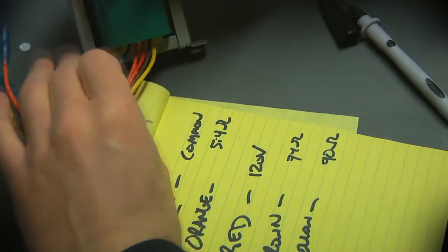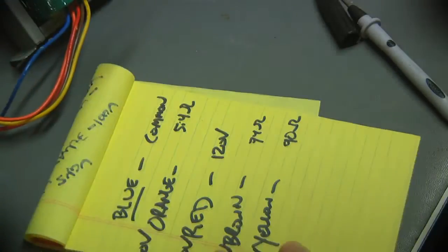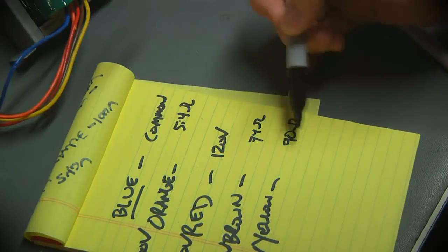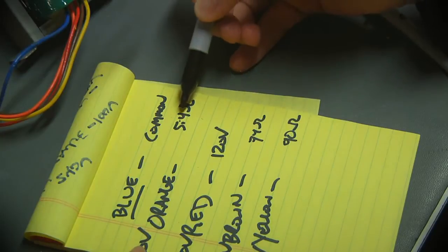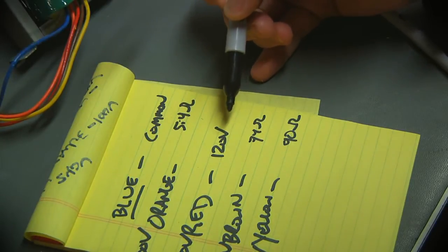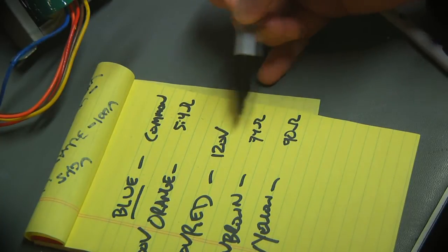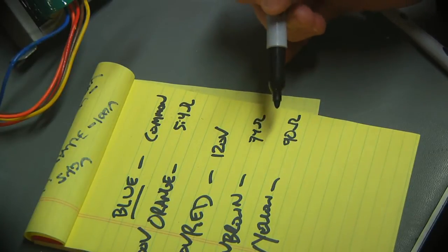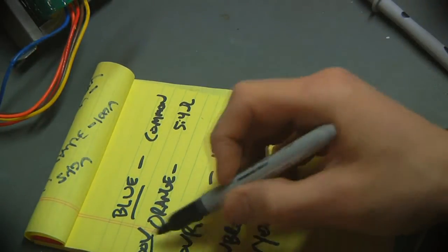That is exactly how these things come off the transformer. And it does match the resistances that we measured, at least in terms of ratios. 120 to 100 volts is a very small resistance. They would be pretty close together in terms of where those taps fall. 120 to 220 is fairly large, but 220 to 240, it's only like 16 ohms difference. So I think it all lines up, it all makes perfect sense.